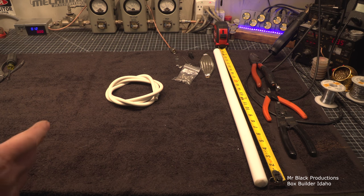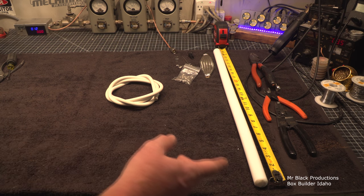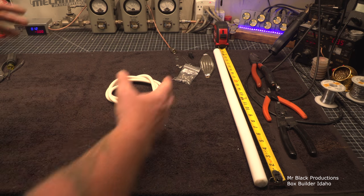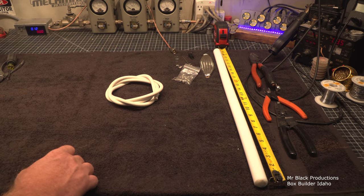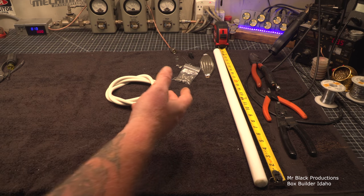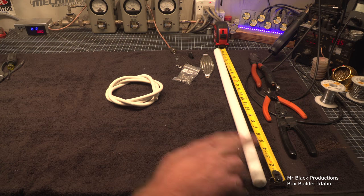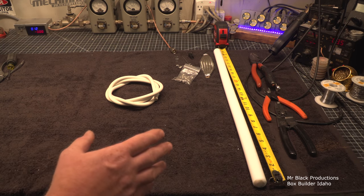Now, believe me, in the electrical world that I come from, being a power lineman, at 50 and 60,000 volts you've got body shield on, three-layered insulated gloves, and arm protection armor, all made of butyl rubber and silicone. Everything's grounded out. When you start getting into thousands of volts, this is just the beginning of the safety for you to be able to interface with it and make sure everything is neutralized.